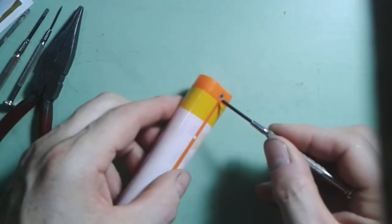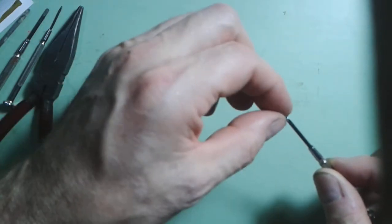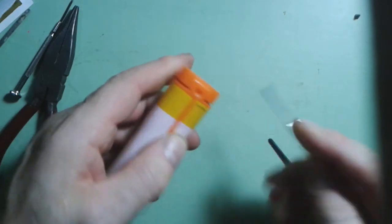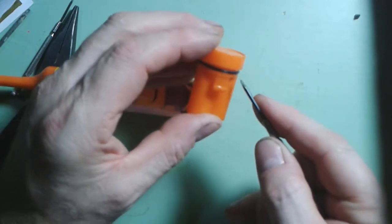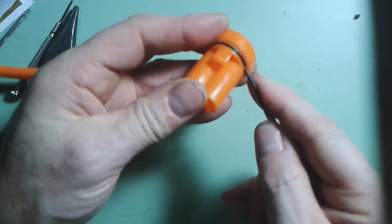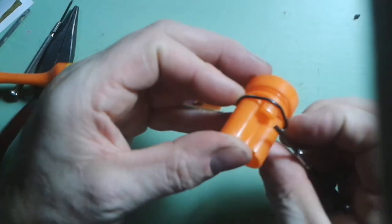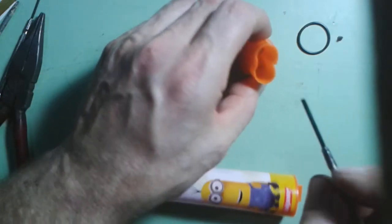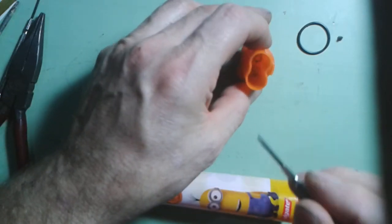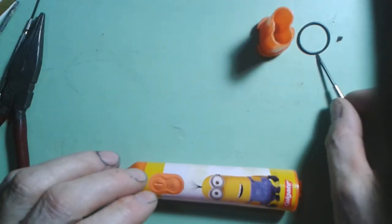You need to start by taking the little screw out of the end. Notice how the screw is not particularly rusty — that's because it's stainless. You may need to use a screwdriver just to help the end off, and you can pull that off. Around the end there's a little rubber elastic band type seal which you can prise off and remove. There's the base section with the screw, the seal, and the base unit.